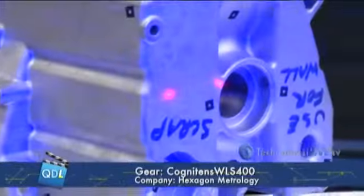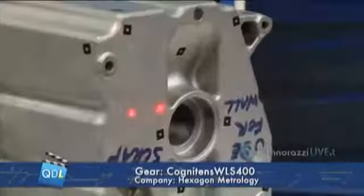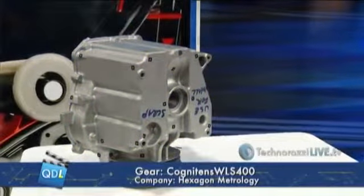To give you an example, you can see those two red dots on the part — that gives you your standoff distance. It's not very sensitive; you can be plus or minus two to three inches. You just point and shoot, and you're done, and then that quickly you can shoot again. If you have the two dots right on top of each other, that's your optimal focal point, but you can be a little in or a little out and it will not affect the measurement of the part.